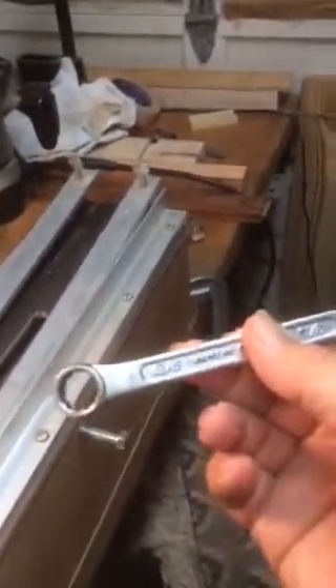And that will give you your ski ramp that you need to cut your truss rod slot. Get some bolts — I'd say 9 sixteenths on the ends — and get some T-nuts to put inside where the bolts go. You can see them down there — you screw them in. I would say those probably need to be put in before you put it together, because it's going to be kind of hard to get inside here and screw these down. But anyway, you can do that.